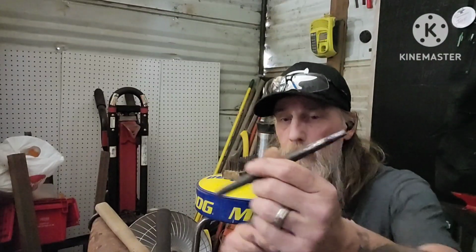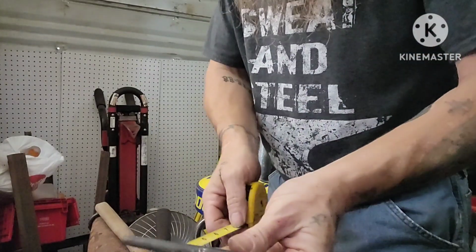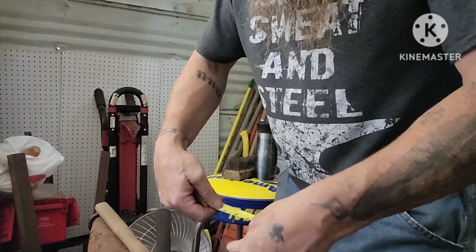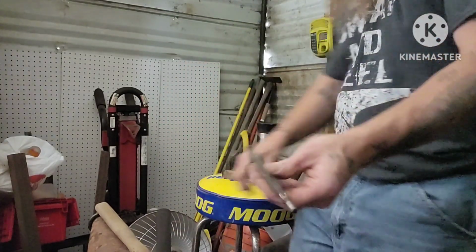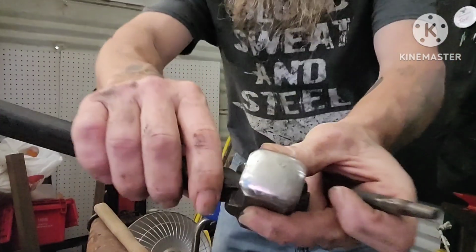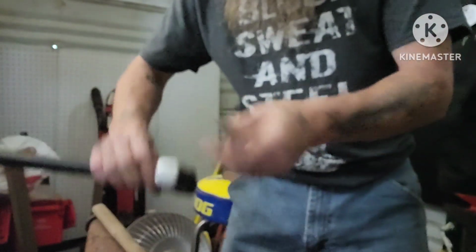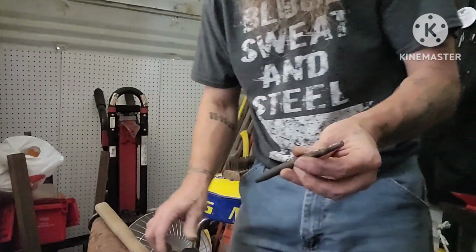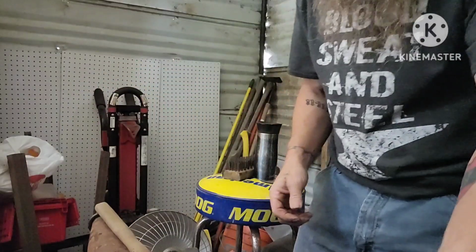Alright, I found it. So, this is the coil spring punch that I just made. It is 3/8 spring. Moved it like butter. Nice light whippy. Nice and hard. I mean, no marring. You can tell it's been used. No marring on there. Both sides. I mean, nice and smooth. Besides the scuff, the discoloration doesn't look like it's even been used. But yeah, I drew that out, taper down both sides. No problem. And that did a great job.